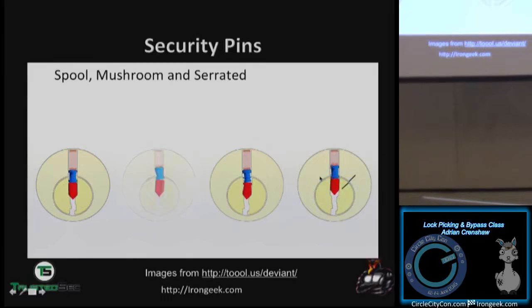Some of those colored padlocks you're passing around, that have different numbers of pins in them, I actually had to go in and throw out the spool pins and the serrated pins, because in their default state they're probably impossible, really hard to pick. SOB, has anybody picked that purple one yet? That purple one I left with you, did they open that yet? No. Okay, didn't think so. That one has like two spools in it. All the pins in it are serrated except one straight key pin. So it's a bear. But these little dips make that extra spot on the shear line where you can get caught up, and you can't lift it all the way and you can't open the lock.